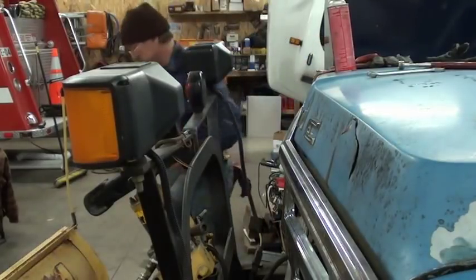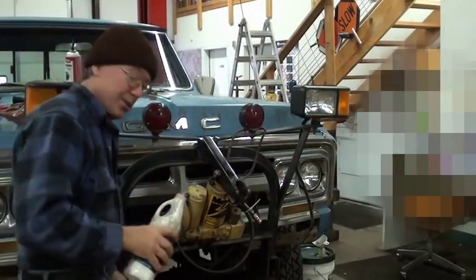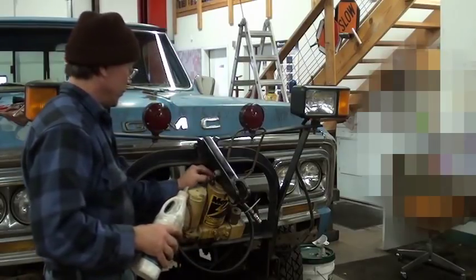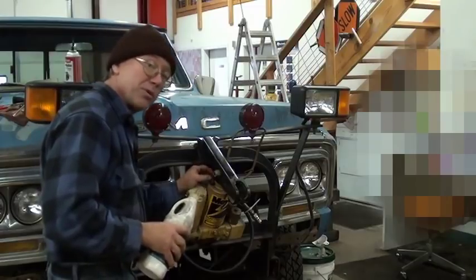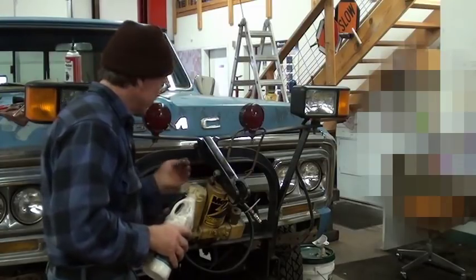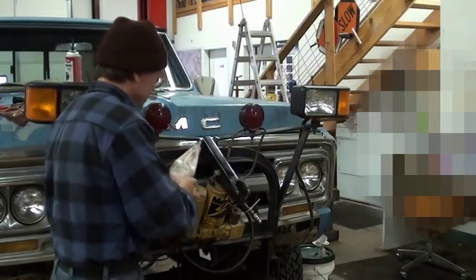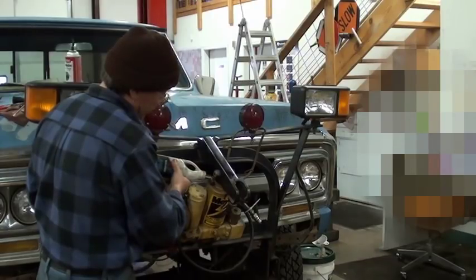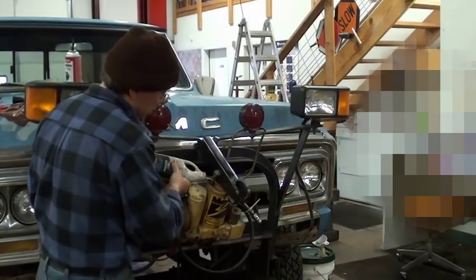More hydraulic oil. Now Smith Brothers has YouTube videos as well. If you type in Smith Brothers Meyer's Plows, you'll get some of their videos. And he shows making a dipstick out of a tie wrap, and that you want it about an inch down from the top of the cylinder. However, the cylinder he's measuring is perfectly vertical.